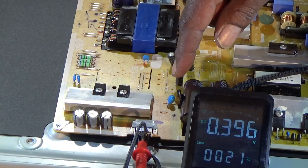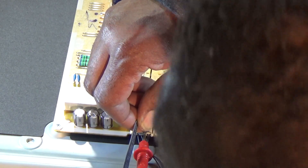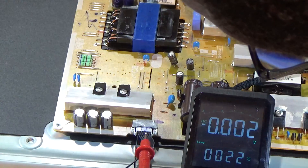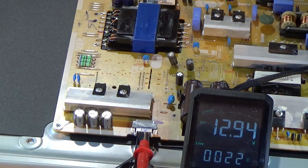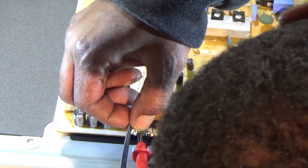I should be getting power supply on, which is the next pin, and I do have 3.3 volts for my power supply on. So it is getting that. If that's the case, we should be getting our 13 volts — power supply on. Going to the top pin: 12.9 volts. So what I'm missing is, looks like, the backlight on — or OD on-off — and the backlight pulse width modulation. There's nothing there.